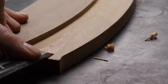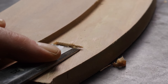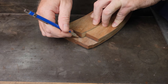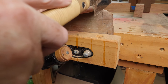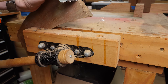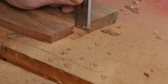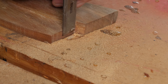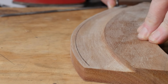Not the cleanest finish, so I used a chisel and some sandpaper to clean it all up afterwards. Here I'm just cutting the desired pattern out of the ends of the pieces, before cleaning up with a chisel. Now you can see tear-out on both sides of these pieces of wood. So I traced a small pattern that I could cut away with the bandsaw.